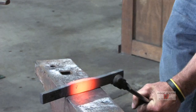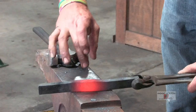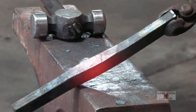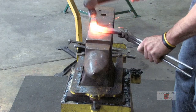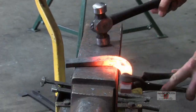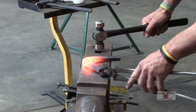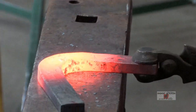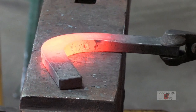I'll narrow it up on this edge to get the outside edge thicker. With an inch in there, when I brought my hammer down it expands the metal. I've already got a thicker outside edge — cracking the toe, bringing it over, and then tightening it up. What I'm going to do is get this pucker out on the ground surface right there in the center, then I'll come out and run it all the way back on the foot surface.